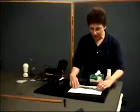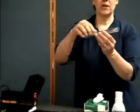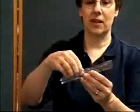To do this lab, we need two fairly thick and flat plates of glass and a source of monochromatic light. The way you would preferably want to do this is with a light source like this one, which puts out green light at a known wavelength, 540 nanometers. This is, in fact, an inspection lamp for this purpose.